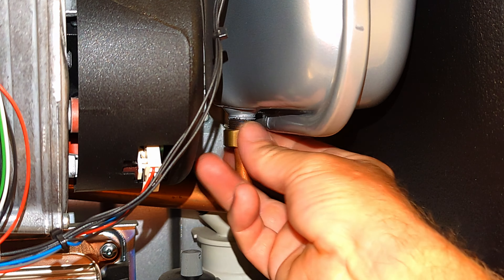I refit the air intake — I only removed it because I changed the pressure sensor; normally you wouldn't need to remove it just for the pressure vessel. Regarding whether the original pressure sensor needed replacing: I refitted it and checked it, found it was over-reading and a bit sticky, so after checking with the homeowner I fitted the new one. The job is finished and the boiler is back up and running. If you want to know how to change a pump, click the link; for the full playlist, click the other link. Please give me a thumbs up, share, subscribe, ring the bell, and see you next time.